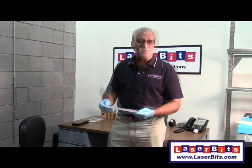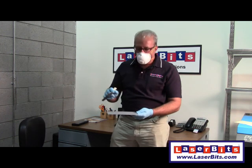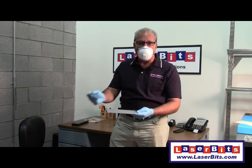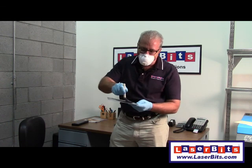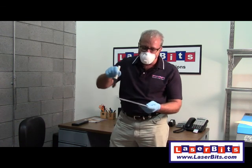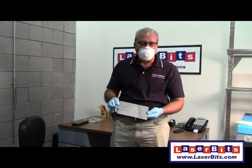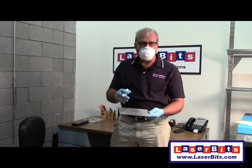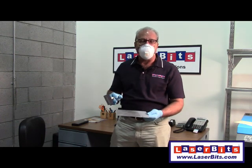We're going to illustrate just how soft it is by using a brush. We've applied the Thermark LMM14 product, and you'll see that it dries to a powder. I've applied gloves and a mask to protect me from the powder getting onto my skin or into my lungs. This powder just wipes right off, which is a problem — while the part is in the system, it can be drawn off by the air assist or the exhaust system, causing a density shift in engraving quality.